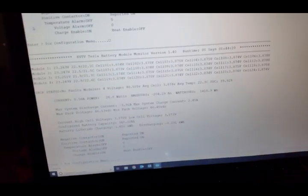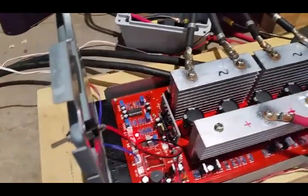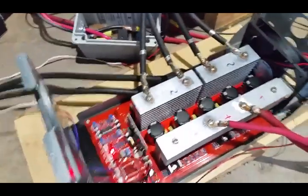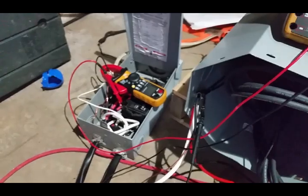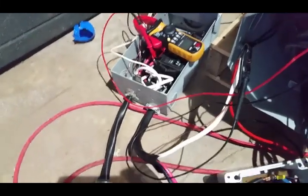There's the computer monitoring the battery pack. Currently I'm at 46.5 volts, and I'm pulling in about 30 watts — but that's with the transformer and inverter hooked up as well. The inverter is powered on but not enabled yet — all I've got to do is click the switch to enable it. It'll make a humming sound. I have it going through those breakers and I have a current meter to monitor the amps coming out.